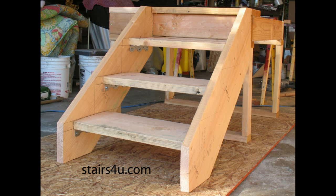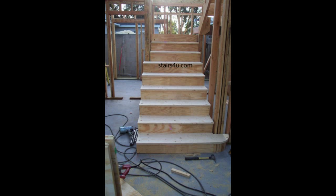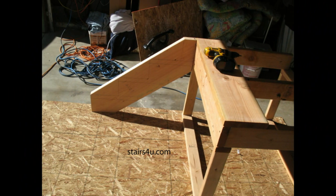In this video I wanted to provide you with another method to build a set of stairs — using metal brackets to attach the treads to the stringers, instead of the conventional method which requires you to notch the stringers and then apply the treads and risers over the notched stringers. That is the most common method, however there are reasons why you'll need to use brackets.